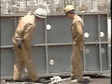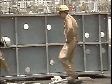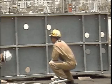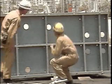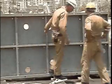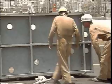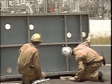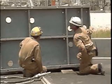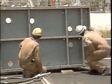The underside of the baseplate should be inspected and any additional grout pour holes, vent holes, or jack screw holes installed. It is imperative that each compartment of the pump baseplate have at least one grout fill hole and an adequate number of vent holes. Vertical and horizontal edges of the baseplate that will come in contact with the Chockfast Red should be ground to a minimum of a ½ inch radius to reduce the possibility of stress concentrations in the grout.